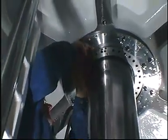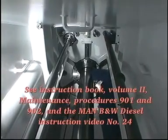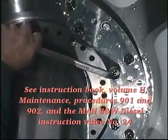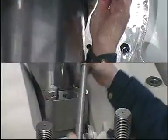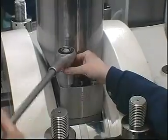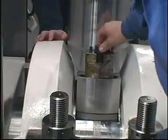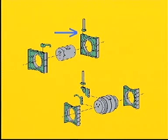Loosen the stuffing box and piston rod foot. Mount distance pieces to protect the stuffing box. The telescopic pipe is fitted either to the guide shoe or to the cross head pin. If the telescopic pipe is fitted to the cross head pin, it must be disconnected and suspended before removing the piston and piston rod.